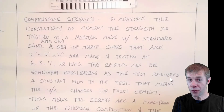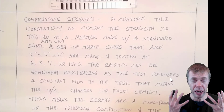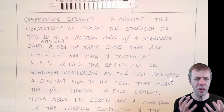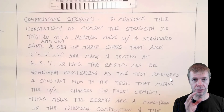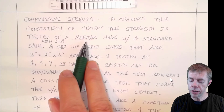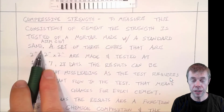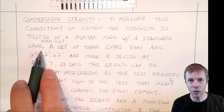The final test in part two is compressive strength. This is basically a consistency test for cement. You make a mortar using a standard sand — a standard sand that meets a very narrow criteria that you order from a single pit. In the United States, you order it from Ottawa, Illinois. You have to ship the sand all over the place to run this test — expensive.